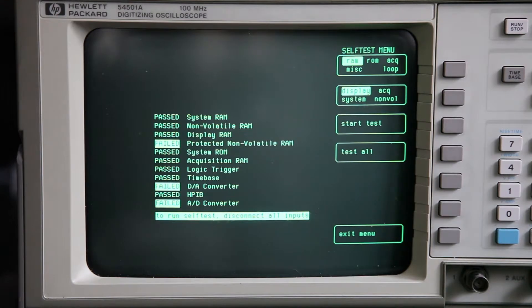This is a pretty typical problem with these. Inside there's a RAM module which has a battery inside, and that battery runs out after 10, 15, 20 years, something like that. And really, you have no choice but to replace it — replace the whole RAM module.